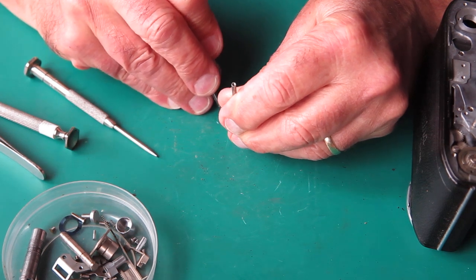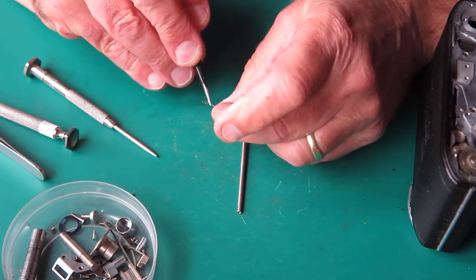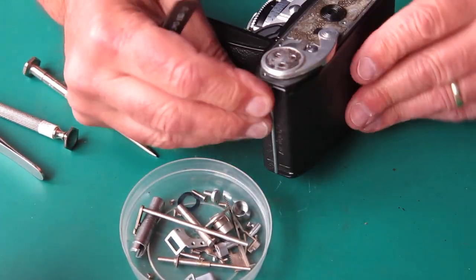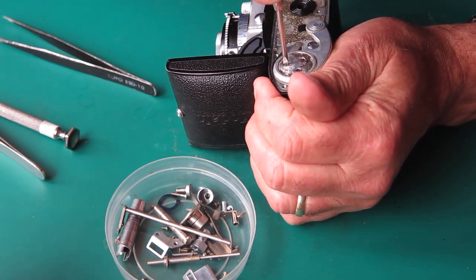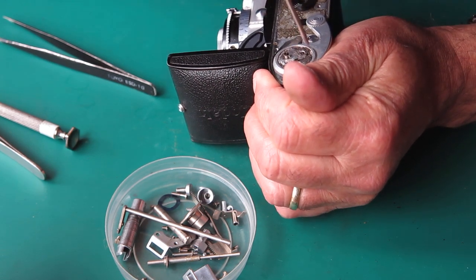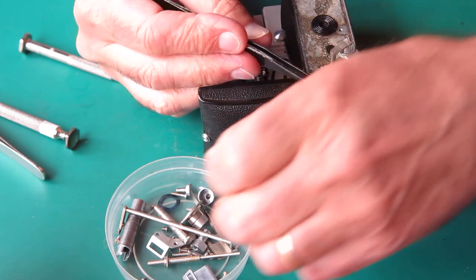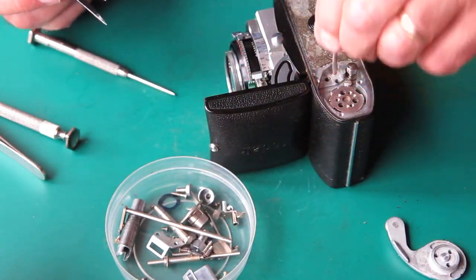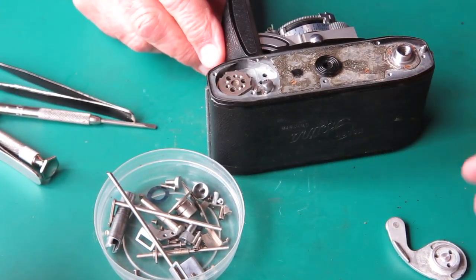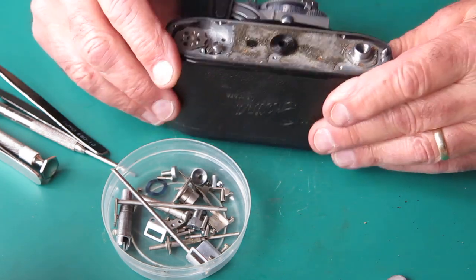Now here I just want to lift that spring off because it's fairly delicate and easily damaged, and I want it out of the way while I'm putting things through the cleaner, because otherwise it'll get damaged. Just remove film advance lever again. Now I did notice when I had this, was able to get the shutter cocked briefly before, that the shutter was very sticky. It was going to need servicing anyway, so regardless of the film advance problem, the camera had problems.